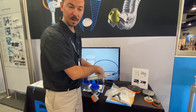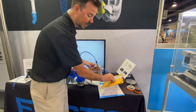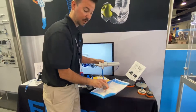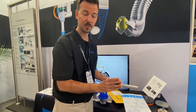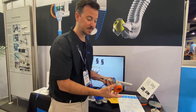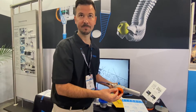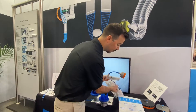This is much better than a vacuum cup that has leakage issues, and we also have multiple packaging types available. If we're using a paper-type packaging we can work with that as well, and with bubble wrap-type packaging it works perfectly well too. It also works well with corrugated product just like a typical foam gripper would. You could pick corrugated or a wide variety of packaging types with a single product without having to do changeover, and we have a very low cost, readily available foam lip as the wear item.